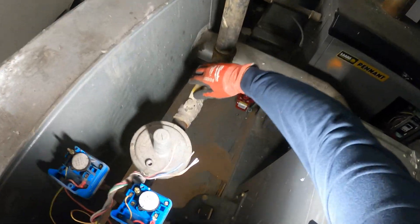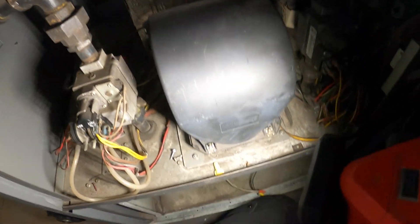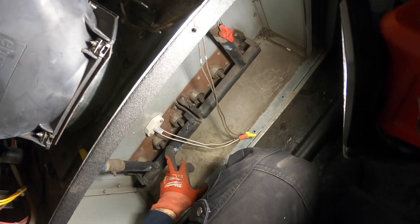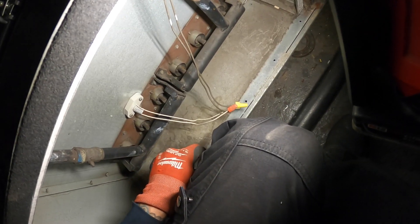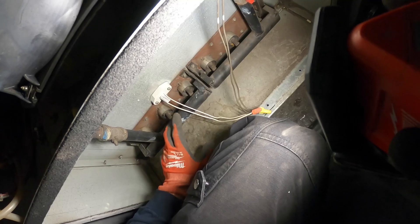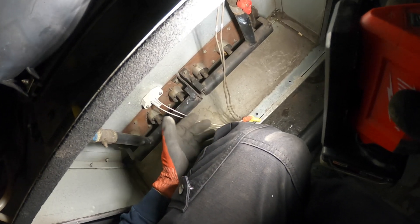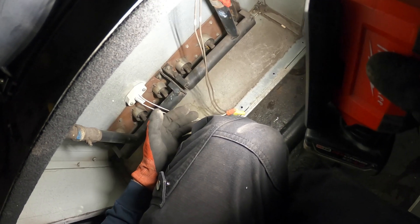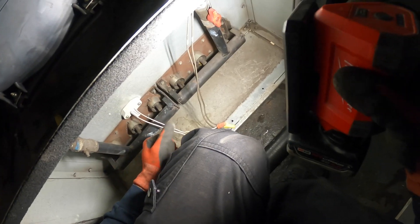This is the gas supply — let's just have that closed. This boiler was running so I want it to cool down; I can feel the heat right now. We got two burners here. This is our header pipe where the gas comes through and then goes into the burner. I did change this hot surface igniter recently to get this machine running, and while I had that open it looked like there was some slight damage to this burner, so I opted for an inspection. I'm going to show you a clip of one of the burners I found. These are all the same age, so if that one was in that condition we've got to check this one and honestly all of them.